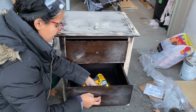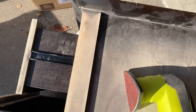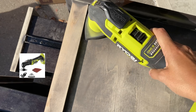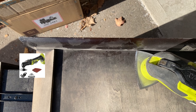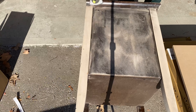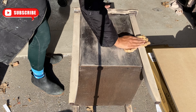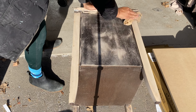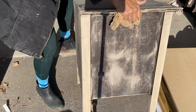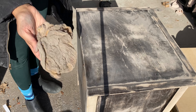I got these really cute gold knobs. To finish off sanding, you need to get into all the tight corners that the orbital sander can't reach, so I use my multi-tool — you can also use a mouse sander. Once you're done sanding, do a quick check to make sure the entire surface is scruffed up. Then use a tack cloth to wipe down the entire surface — don't skip this step or you'll get sawdust in your paint and your surface will be clumpy instead of smooth.